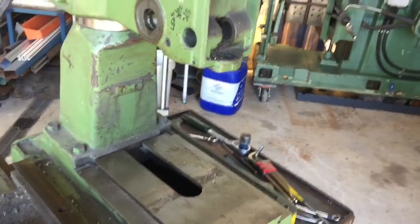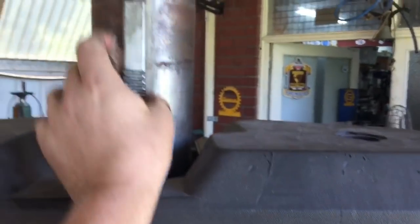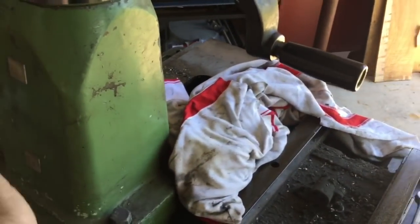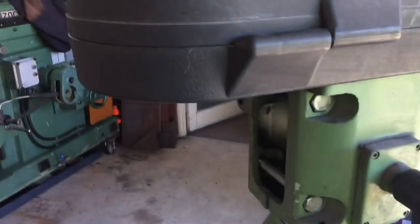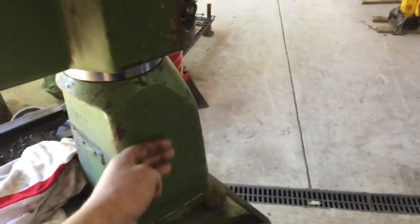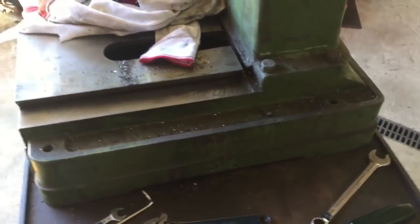Next step is a thorough clean. There's a lot of slop in that, but if we machine that to size, maybe add some key steel alongside and true up the gap in the head, maybe fixing that will give us resistance against rotation. Alternatively, I'm considering something up here in the back — maybe inverting the motor so the motor comes up the top. Or we still have this space here where we could machine a surface and just lock those two in with the two vertical slide arrangements, just to take out any possible twist out of the mechanism. All interesting thoughts.